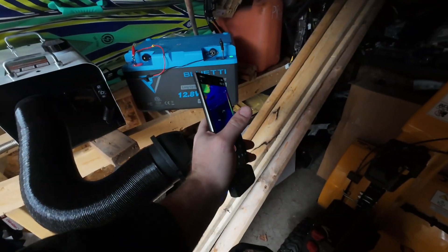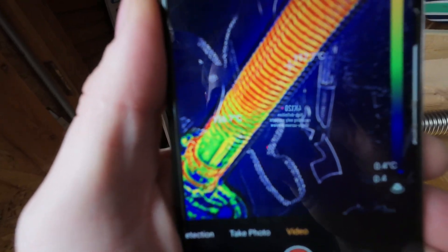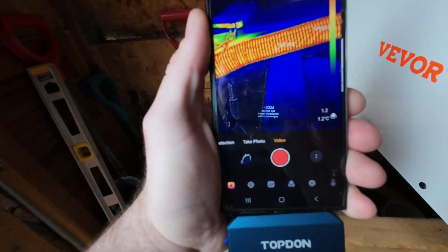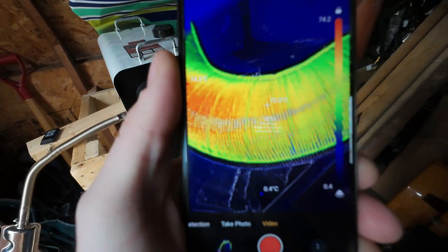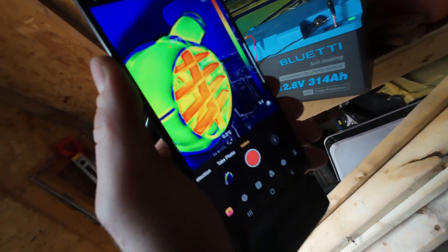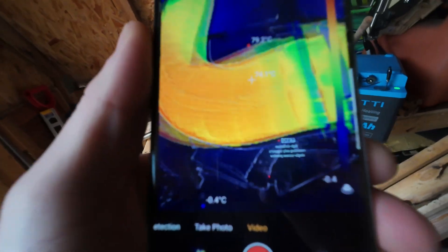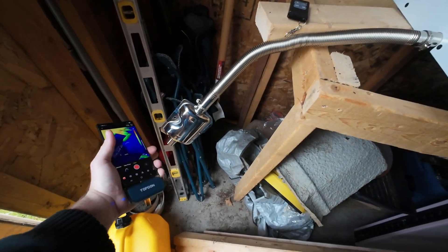Five minutes later and I can tell you right now the heat coming off this is pretty good. Let's go to the exhaust first - about 111 Celsius there, that's pretty good. The heat is transferring over there. Going to the tube - it's hard to show on the video but we're getting about 72 Celsius coming out of the air. About 73, 71 - that's pretty good. You can see the battery's done heating up. This thing - it's comfortable in here, it took the chill out. It's about minus three right now - so that's pretty neat.